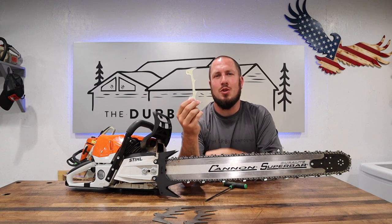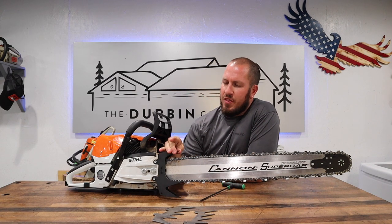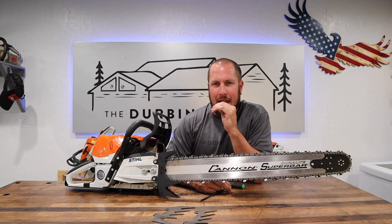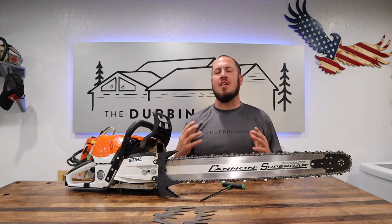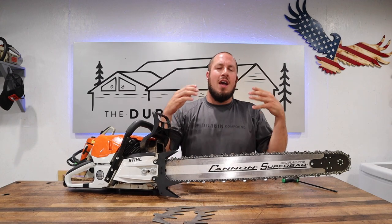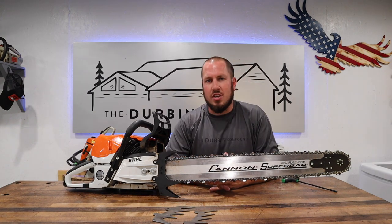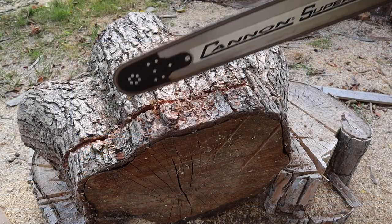Just having those stock spikes on a 462 is an absolute shame. These felling dogs are made of three thirty-seconds plate and they are pretty stout for what they are. I am very impressed with the lineup of both the inner and outer felling dogs — they have literally zero tolerance, they are lined up perfectly. The only qualm I have is that the bottom spike is a little further out for my taste, so the saw doesn't like to sit up straight. But how many times are you going to sit it on concrete? It's going to be in dirt or dogged into a tree, so I understand why the bottom dog is angled out so you can dog it into a tree.